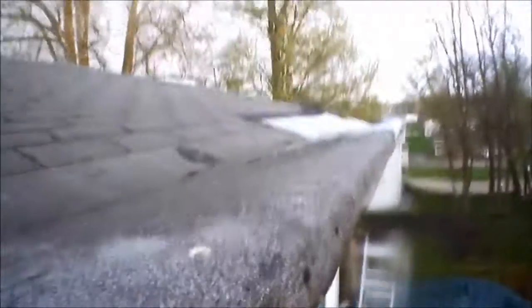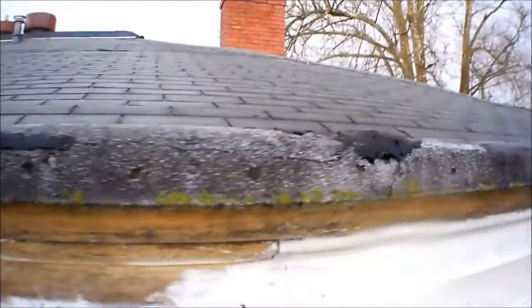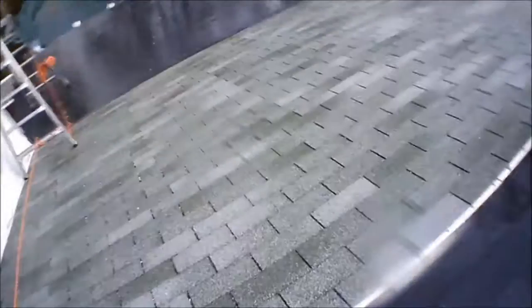The box gutters have been covered up with roofing roll felt. If I was going to go the gutter route, I'd put OSB at the end — the two feet — and then fiberglass over that and put gel coat, and it would never leak again. A lot of people use the rubber stuff out here, but you could also do fiberglass over OSB and then gel coat over that, and that also works as well.